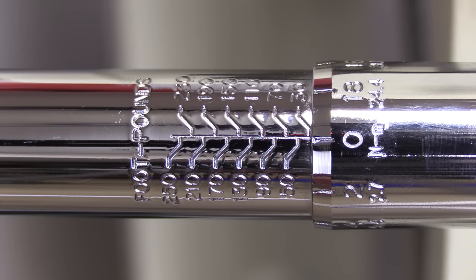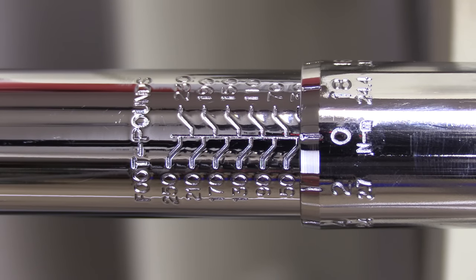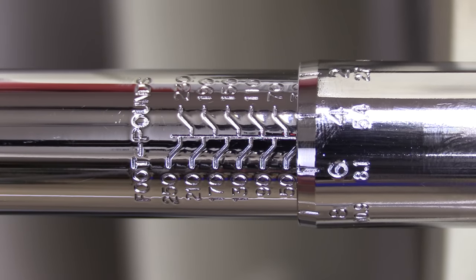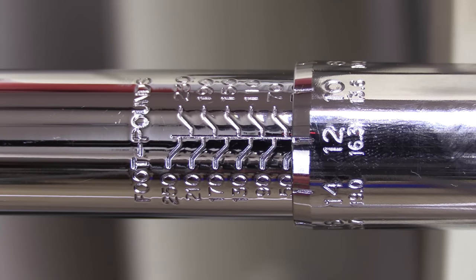The Husky is going to have a wider torque range than the Cobalt, and although the packaging says 50 foot-pounds up to 250 foot-pounds — and that's also what the manual states — when we look at the front of the torque wrench, we can see the actual range is from 30 foot-pounds to 250. Now there are two big negatives with the Husky in my opinion. In one rotation it's going to go up 20 foot-pounds, whereas with a traditional micrometer version in the half-inch range, you would have a 10 foot-pound increase in one rotation. The other thing I really don't like is the fact that it will not stop on any odd numbers — it's only going to work with even numbers. So if you're looking at 51, 71, or 113 foot-pounds, you would be unable to do so with this torque wrench.